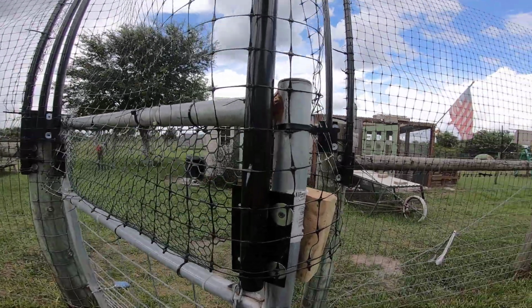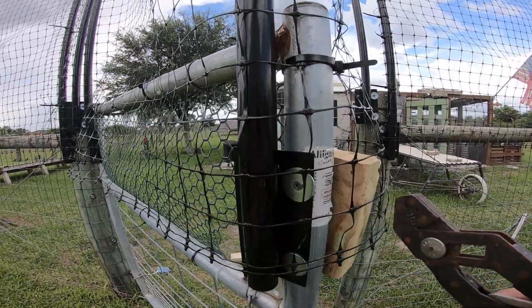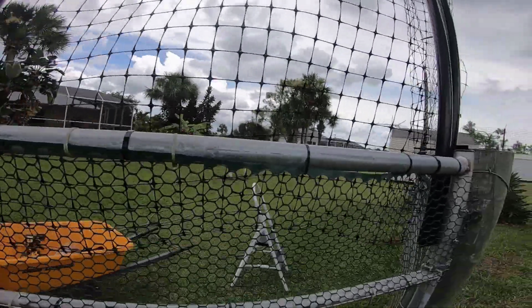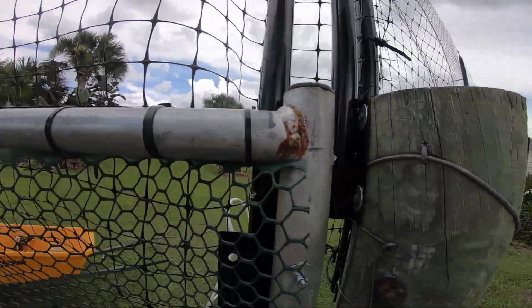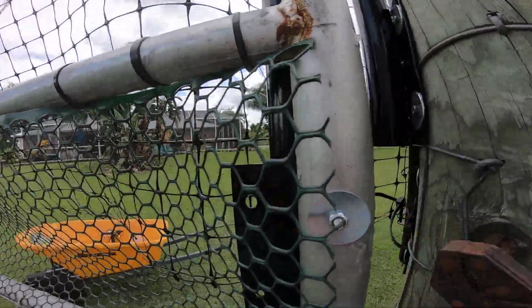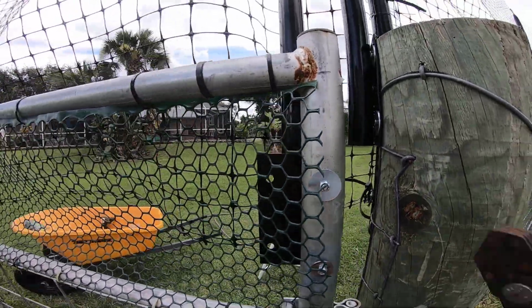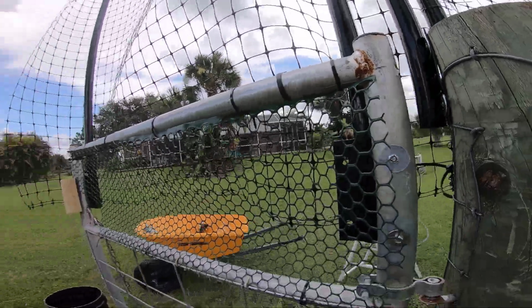Okay, so before I left, I just did a quick rig job here, putting wood screws through into 2x4s in the back, but that creates too much of a problem when you actually try to open and close this gate. So I went to Home Depot and bought some machine screws with nylon lock washers. That is going to be my solution for this area.